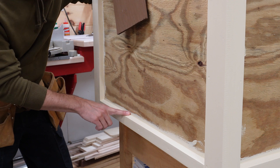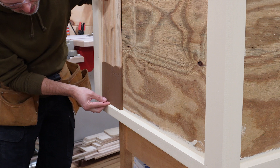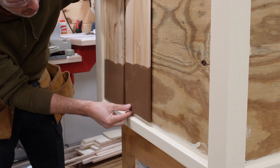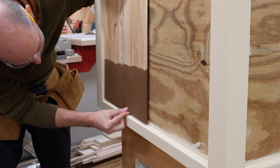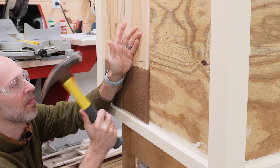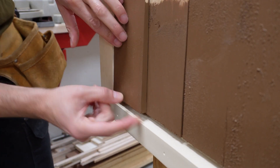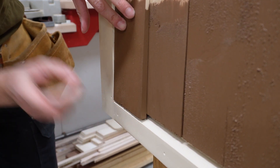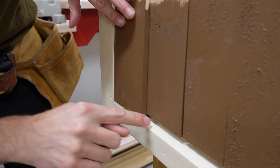To make sure that water sheds away from the planter box, I've already beveled the top of this piece of molding to 15 degrees. When I place my first shingle, instead of butting it directly up against the bottom, I'm going to raise it up about a quarter of an inch. When I place my second shingle, instead of butting it directly up against this one, I'm going to leave a small gap — you can eyeball it or use a nail as a spacer. This small gap will let the shingles expand when they get wet. When I install my second row of shingles, instead of lining it up with the previous row, I bring it down so there's just a small air gap between it and the molding. That way, any water that comes down here and wants to travel inward will drop off the back instead of continuing to migrate.